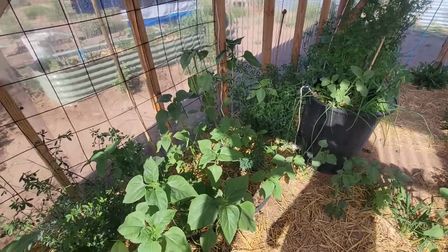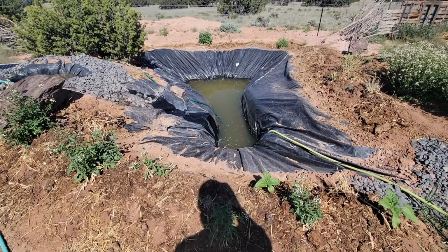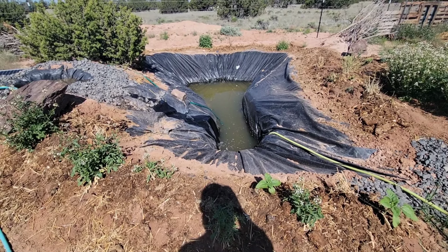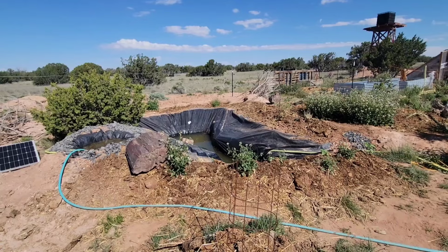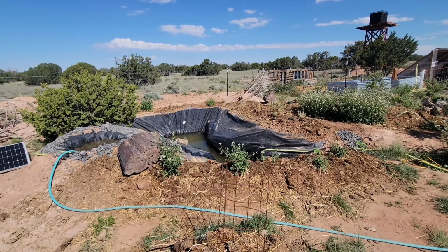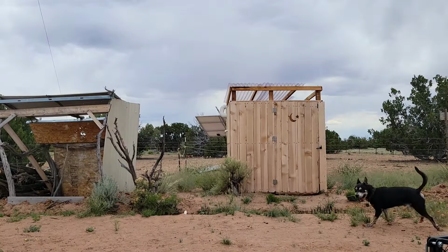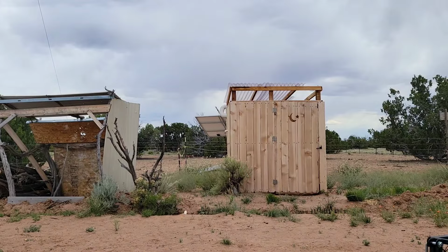The bilge pump I had in the pond for the bog filter died because it wasn't continuous duty. So I had a 400 gallon an hour one laying around. It didn't keep up with the pond, and I ordered an 800 gallon an hour pump. So now we'll see if that completely clears up the algae again like the larger pump did.